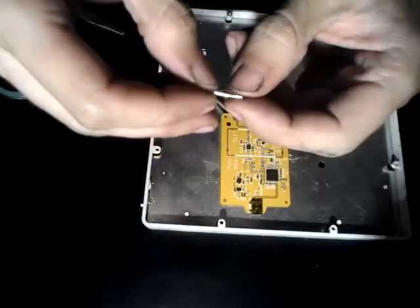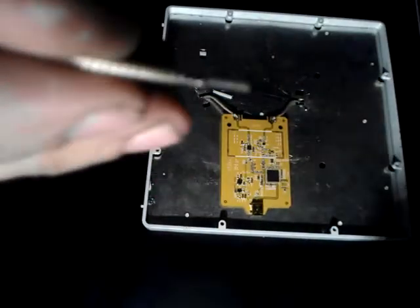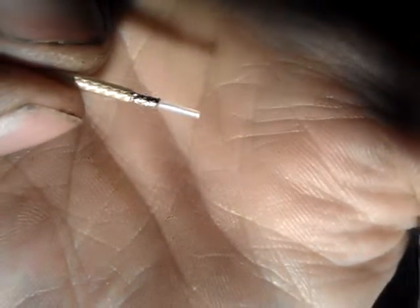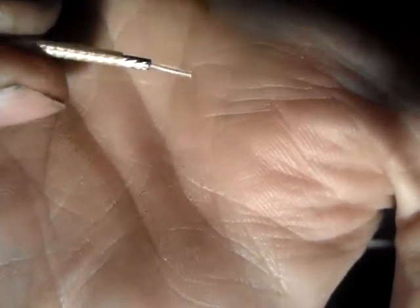I figured out if you cut the outer sheath, solder the stuff, put a little scoreline around the outside, and you just bend it one way and then the other — it breaks it off almost perfectly. There you go. You get a perfect pre-soldered braid and then the center filament.